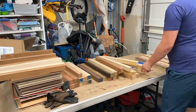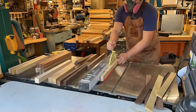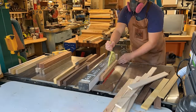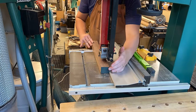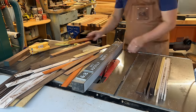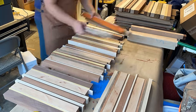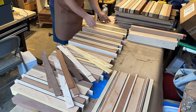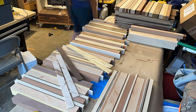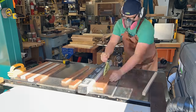Sometimes I go ahead and make patterns right away, sometimes I wait. I cut all of them to different sizes, getting a feel for the patterns. I like symmetrical patterns but also do some asymmetrical ones. I'm adding thinner pieces — they really add a lot to the pattern and contrast. You can do this on a band saw to save material, or at the table saw. Those thin rips are still one and a half inches thick but add really cool patterns. Just be safe when cutting thin ones. I'm targeting about 12 by 18 inches.